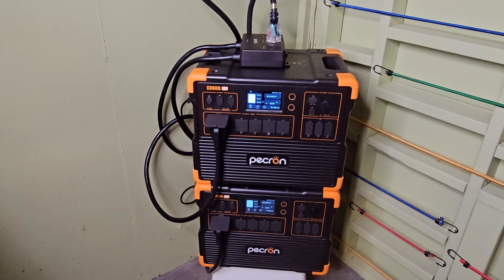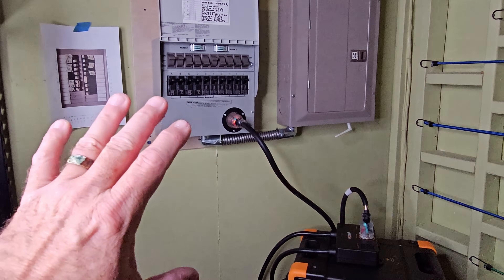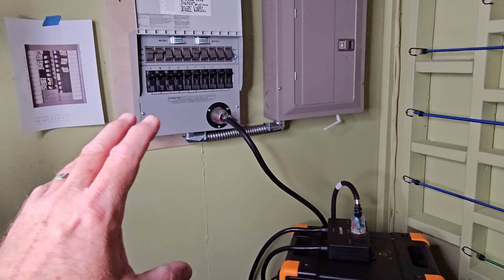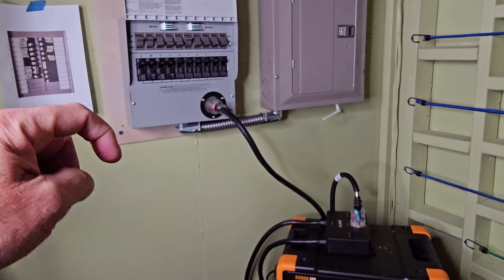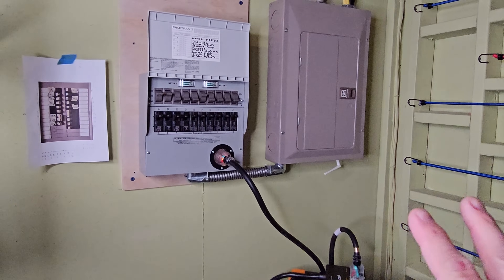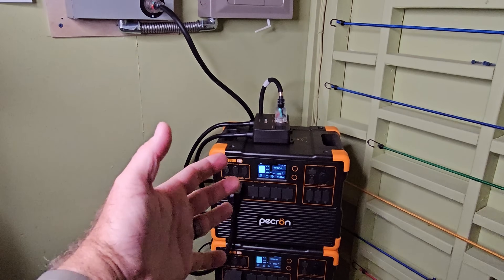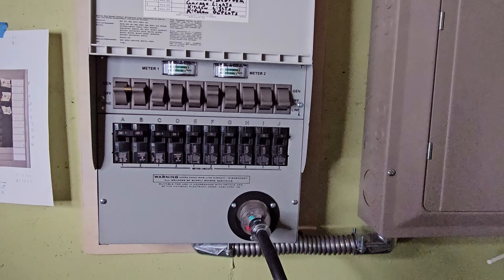You can expand this thing significantly as your budget allows — very simple setup. If you're not sure how to install one of these, I do have a video on how to install a manual transfer switch. You should have an electrician install it if it's required in your area, or if you don't have the comfort level and skill set to do it yourself — because of the voltages involved, you don't want to burn your house down. But they are fairly straightforward. I'll leave that video link in the description below. This allows you to hook up something like this with a standard generator cable and switch over whatever circuits you consider important.